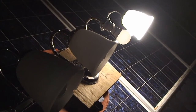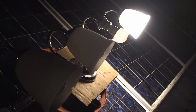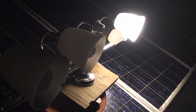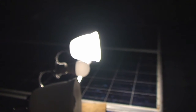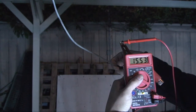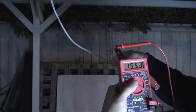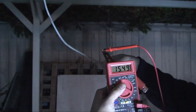To show you how weak moonlight is, I have a work light here with four bulbs — right now only one bulb is on, shining on my solar panel on the roof. Just one light bulb at 800 lumens. Let's see what we got: 15.5 volts with a single light bulb shining on my solar panel array. The moon only got 2 volts.